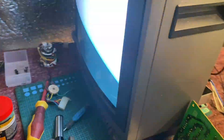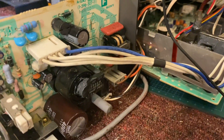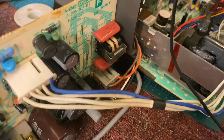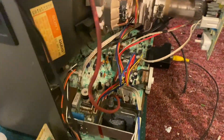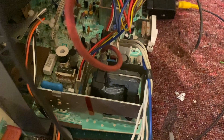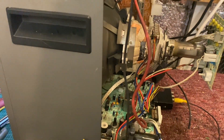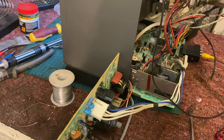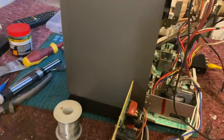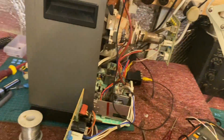Not that difficult a fault in terms of what it is and how to fix it — and the exact same for the line transformer too. It took a while to get there. I'm just so surprised that this core was the fault all along — it was staring me right in the face. I couldn't see the crack in it at all. I bet it's the same material they used on the core for the line output transformer, which is why that was breaking down too. That's amazing. I'm going to do one last shot of the whole thing back together tomorrow morning and call this one done.